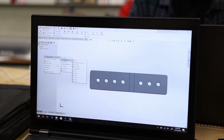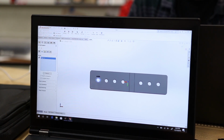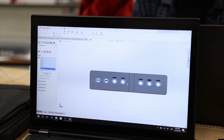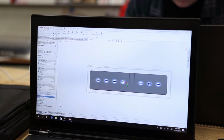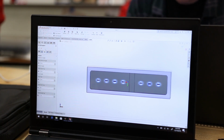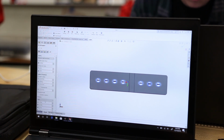When you've done these steps, create another program and select the same tool as last time, while also doing the same heights as the last program. Go to the passes icon and uncheck stock to leave. After you've done the same heights and tools as the second program, click on linking and then go to ramping and then select plunge. And finally, click on the check mark.